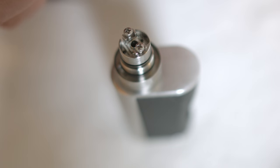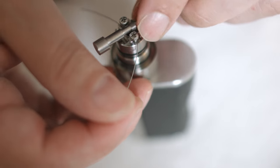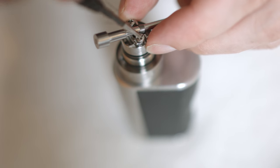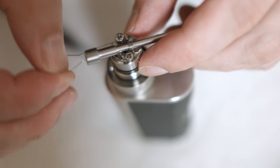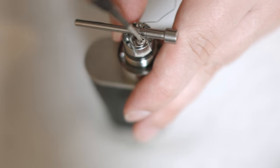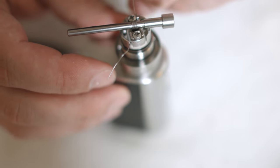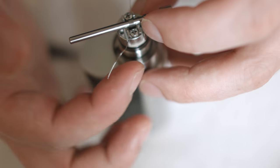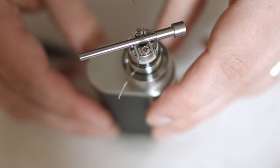I'm just going to put the 3mm bit in the middle and wrap around underneath the screw. Because I'm using quite thin gauge wire, I'm going to go underneath the screw and the other side around the hook. That's one down. On the other side, around the screw and under the opposite hook. Nice and easy. Now if you're using a lot thicker gauge wire, you don't actually have to go under the screw — it's a lot easier just to go under those hooks, and then directly under the screw on the opposite side.